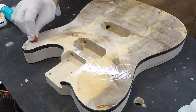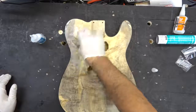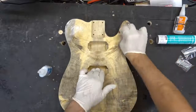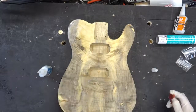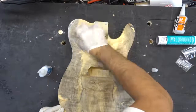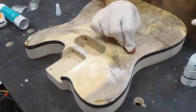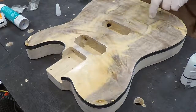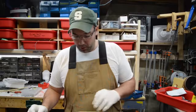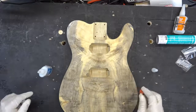But a nice clear finish. So that's the first coat. See some stuff sitting. It's looking pretty good. We've wiped up anything that's floating. This stuff is rock hard now. And the reason I'm using this super glue on the Buckeye burl is Buckeye burl can sometimes be a little bit spalty in spots. I've got a crack running through this right here, and so this will help fill that crack and hold the wood together.